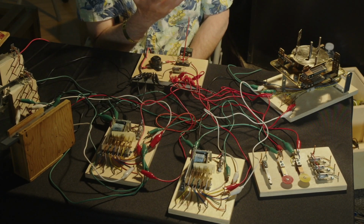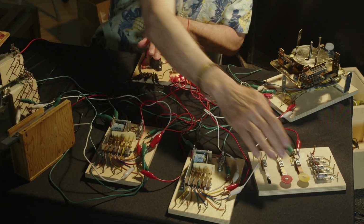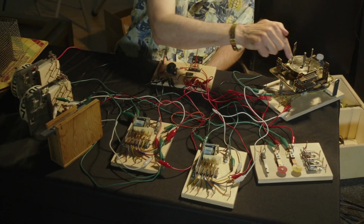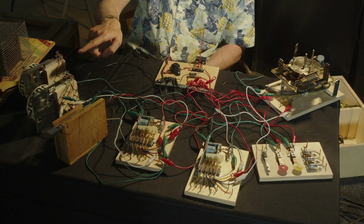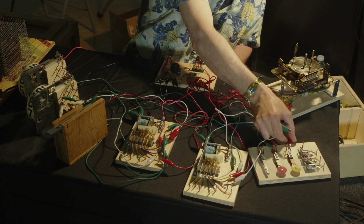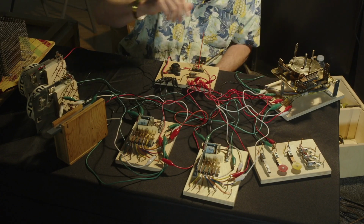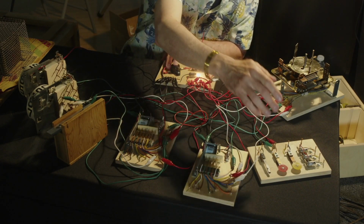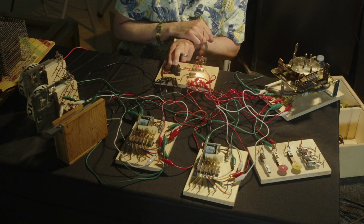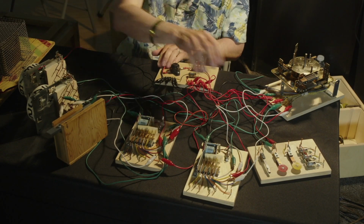And the final step, is that right? Final step? Yeah. We've had all along our buddy, the 10-point relay over here, right? Well, now, rather than using that target, I want to use the motor to send 5 pulses into my score reel, right? So I'm going to take this off of here, and I'm going to connect it to the switch that closes 5 times. And fingers crossed, I think it's good. Right? Yay! It's always nerve-wracking. No, it works great.